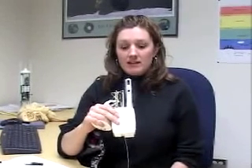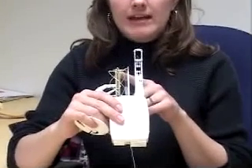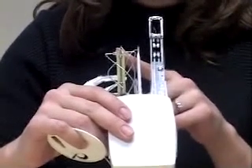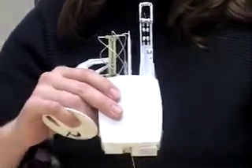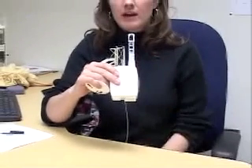The radiosonde is a small, lightweight device that is encased in styrofoam and plastic. It's equipped with multiple sensors, including a GPS sensor which allows us to track the location of the radiosonde in flight. It returns latitude, longitude, and altitude data, and from that information we can figure out what the wind speed and wind direction are. The radiosonde is also equipped with a thermometer that measures temperature, a barometer which measures pressure, and two hygrometers which measure relative humidity or moisture in the atmosphere.